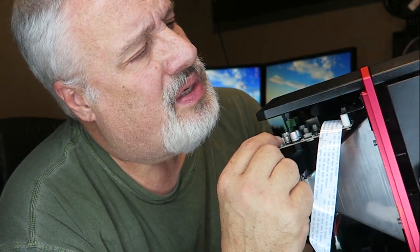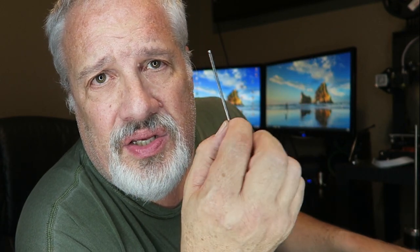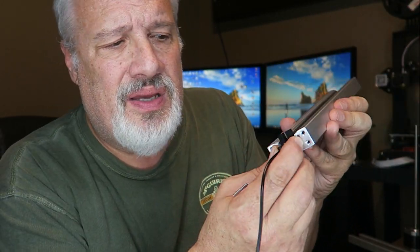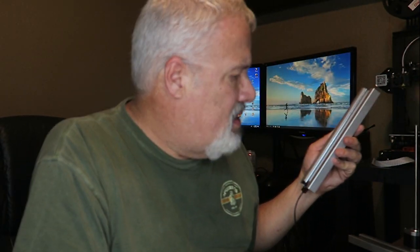So not that big of a deal. I've got them tightened up — I tightened them a little bit past finger tight. You don't want to over-tighten this because this is plastic and there are components in here you could mess up. Now what I'm going to do is work on removing the Z motor and the rod. Since this is out of the way, I'm going to set this aside and get back into the photon.